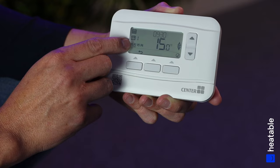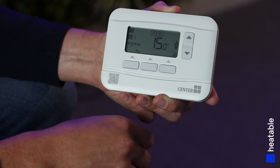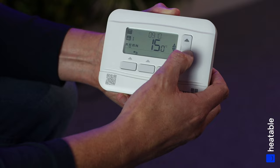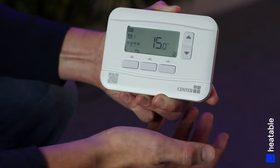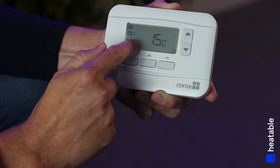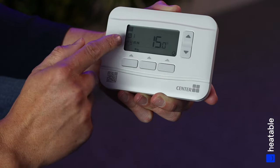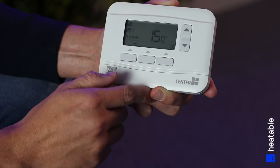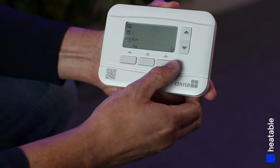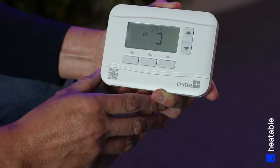Program 2 is now flashing. P2 and P4 are off positions; P1 and P3 are on positions. Here we're saying at 9:30 we want the boiler to turn down to 15 degrees — press OK to adjust, move the time to where you'd like. In this example we're setting 10am at 13 degrees just to keep the house tepid. Save that.